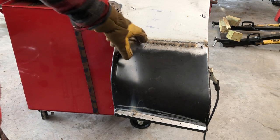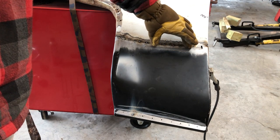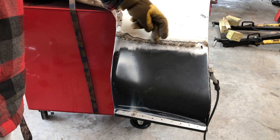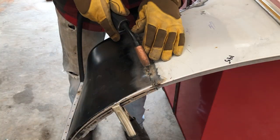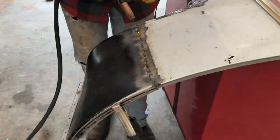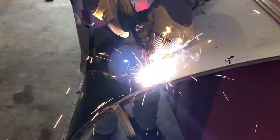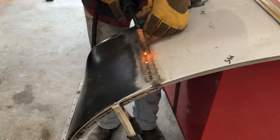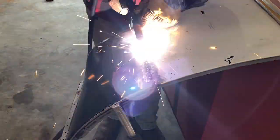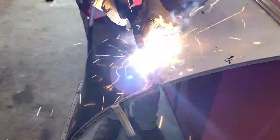You'll see that I'm continuously moving around in my spot welds, being sure to space them apart so that I don't get the metal too hot and end up warping it. I'll run a series of spot welds until this entire area is completely filled in. Now what I'm using here is a flux core welder — it's a wire feed welder, very similar to a MIG welder. However, instead of the machine and an air tank supplying the gas for your welds, this machine uses a wire that has the gas inside of it already. So using this, your welds are a lot dirtier — you get a lot more slag and a lot more spatter. I like using it because of its convenience. It's a lot cheaper than having a MIG welder, and at the end of the day it still gets the job done.